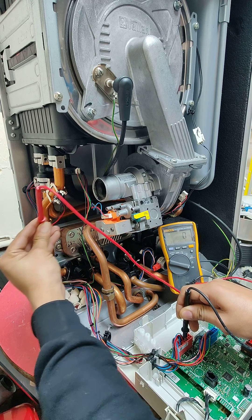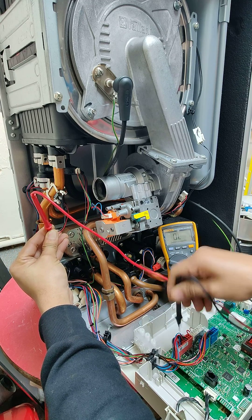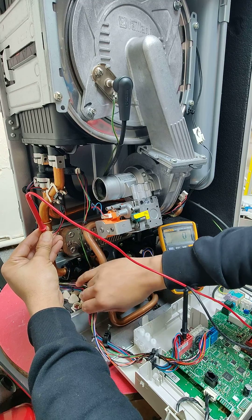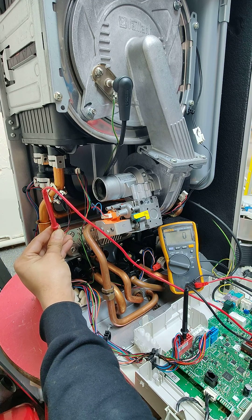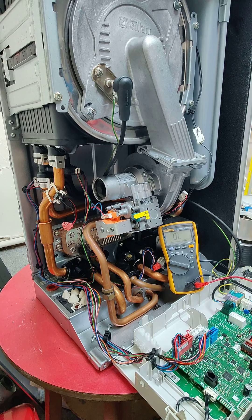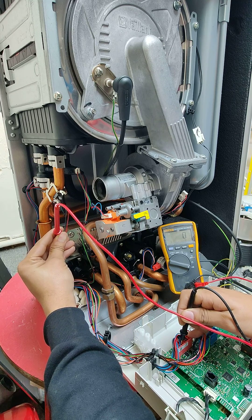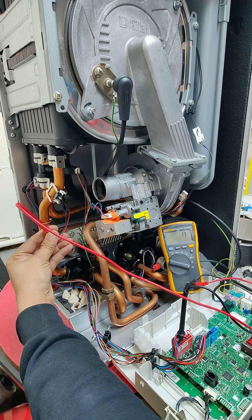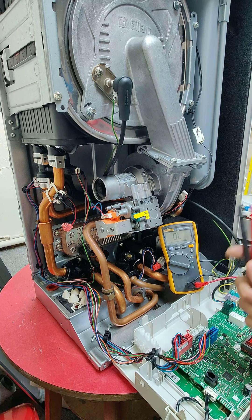It's always good to move these cables about slightly just in case there is a break that's not showing right now. If you move the harness about, just make sure the break isn't hidden and not showing as continuous when it actually isn't. That's the way of testing a cable for continuity. Similarly, if we want to check the black cable next to it, we go between black on the connector and black on the actual cable end feeding the thermistor or NTC — and it will show continuous if it is continuous, or show a break if there is one.